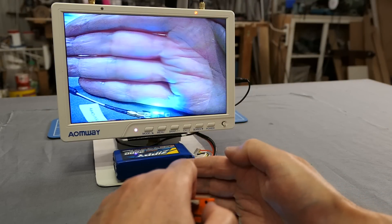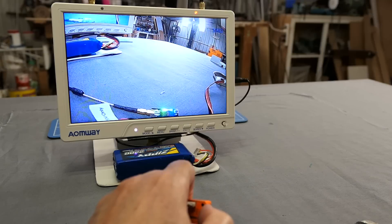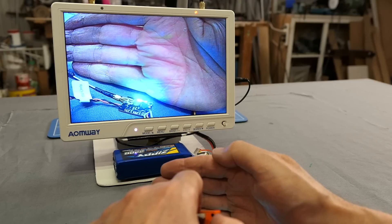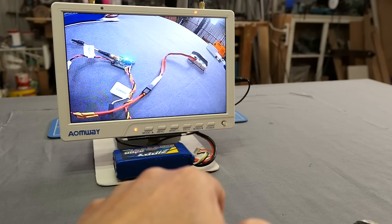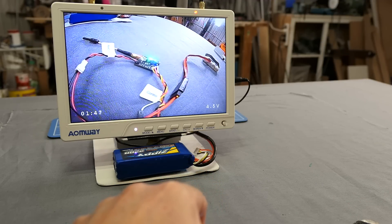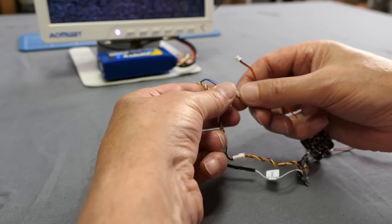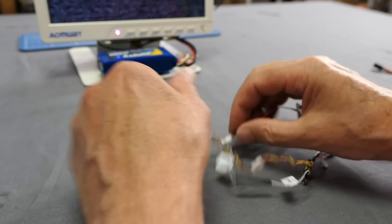Hold for 3 seconds and we'll go to frequency — we've got E1, E2, E3, E4, back to E1 again. If we just do nothing, that should accept the selection — there we go. So we've confirmed: sunny, 200mW, 5.8GHz frequency. That's very cool. And of course you still have the keypad changer — you can just plug that in and change things as you used to do, or you can use the funky hand gestures.